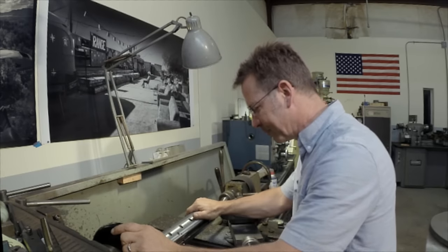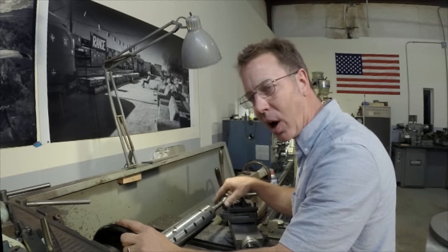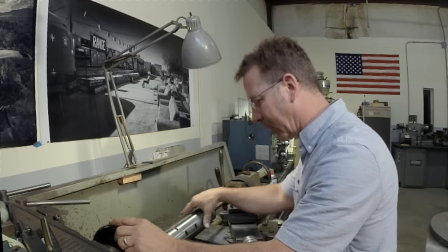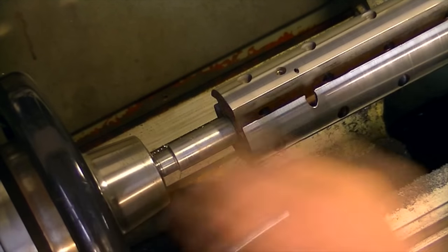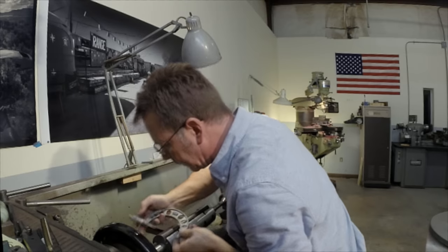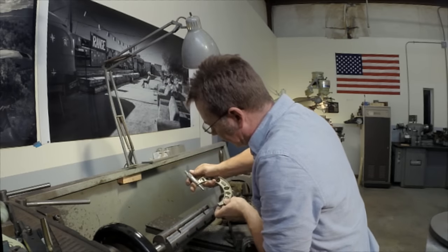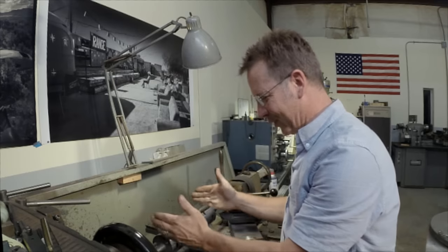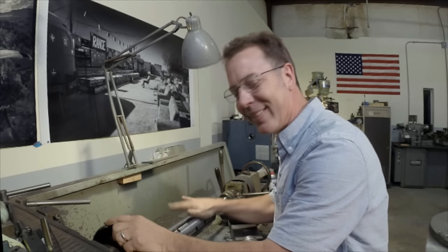Well, I just finished up my final cut. I've got to say it's working out really well. I had some challenges with the finish — I had the cutter at the wrong angle. I tried a bunch of other cutters off camera just to see if I could get a better cut, and I actually went back to originally what I started with. So it says I kind of knew what I was doing, which is rare. The finish looks good. Let's do a measurement. About a half a thousandths. I think I'll take that over twelve inches to be a half a thousandths off — if I made a little more detailed reading it's probably a little bit closer. So I think that's definitely within tolerance of what this is going to be.